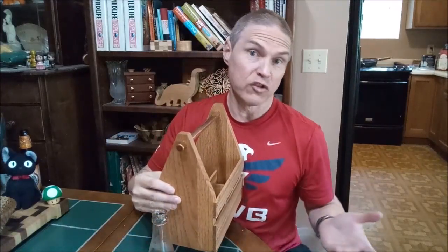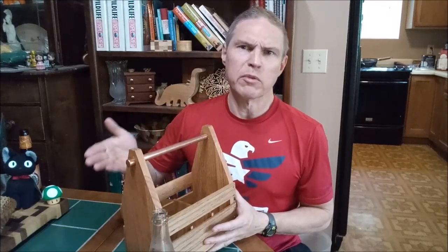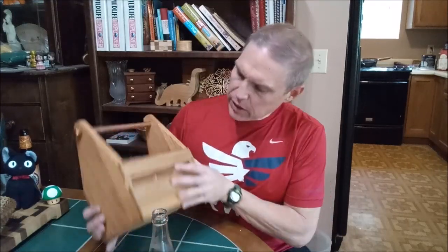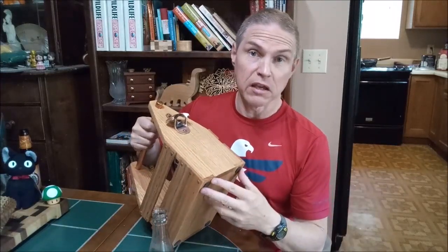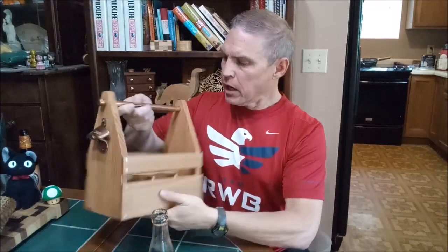You saw me getting ready to make the cut, and it just turned out I was not comfortable making the cut that I was lining up. So I went ahead and cut it out on the scroll saw, although again, it would have been fairly easy to set up a jig and cut it on my table saw using the sled. So anyway, not a difficult project, but just some details that caught me by surprise a little bit. And of course, you saw me do the scroll saw work down here on the joint, just to add a little bit of extra strength. I was a touch worried about it, but if I were going to make these more often, I'd throw a dado stack in the table saw and run them out that way. I don't know if I'd box joint them all the way across, but this is certainly going to be strong enough, I think.